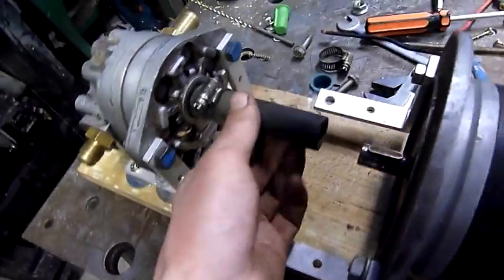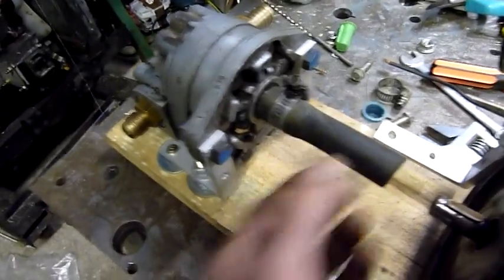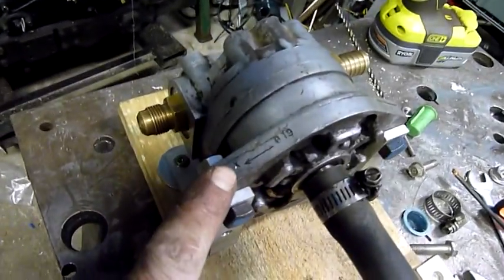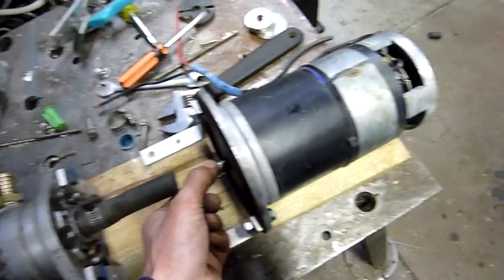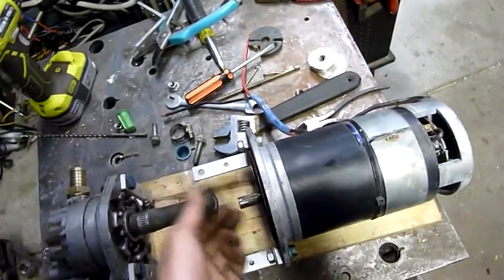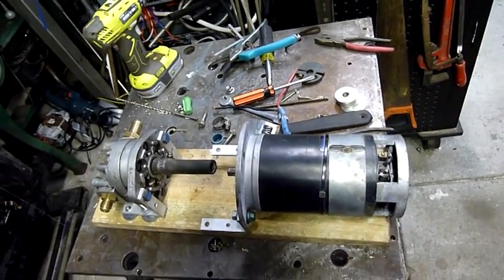I've got the pump bolted in - bolted and screwed. And that's all I'm using: a bit of heater hose off-cut, should work quite well. It's got to go anti-clockwise looking at it from the drive end - there's even an arrow on the pump housing indicating the direction of rotation, so the fluid comes out of the high pressure port. As for the motor end, I'm trying to find a little adapter I made a while ago - just a 20mm sleeve with a key slot that fits over these shafts - but I can't find it, so I'm just going to stuff the hose over the keyed shaft and use it as is. Doesn't really matter.